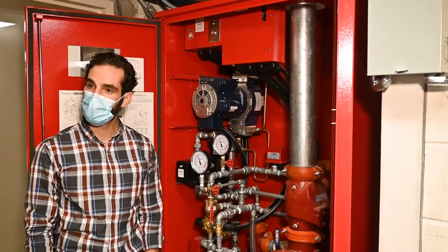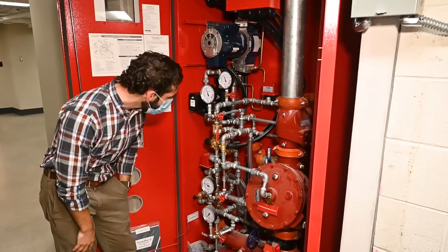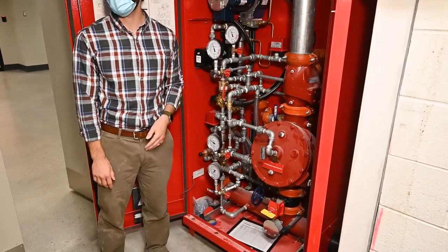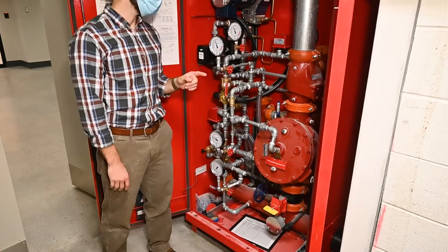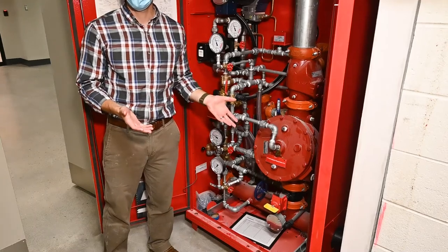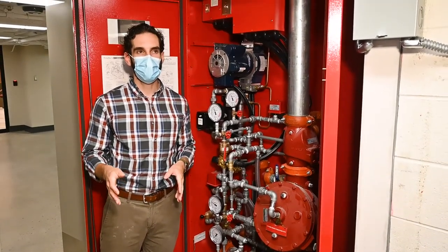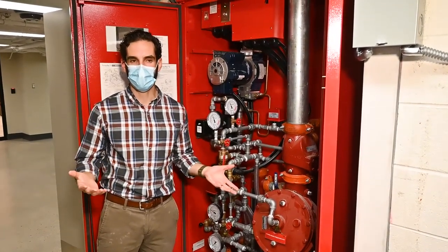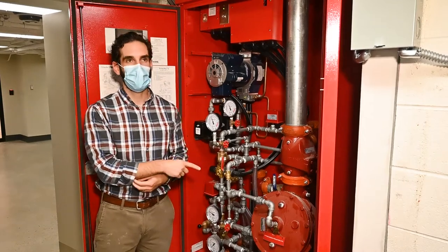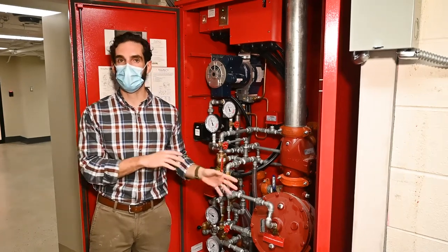What's the purpose of the clear flexible pipe? This is for visual verification when the system's working — you can see water drain out through there. This is a more special pre-action cabinet — this is a Surefire system. The Surefire system works where if the building ever loses power and then the battery backup is expended — another 24 hours — and power doesn't return within 24 hours, the system reverts to a dry system. You don't need any smoke detectors — if there's ever a fire, for life safety purposes, it can still discharge.